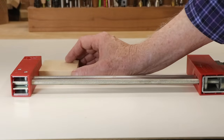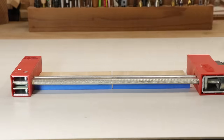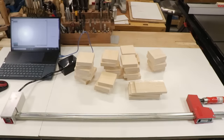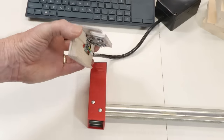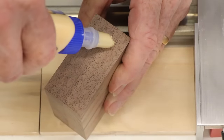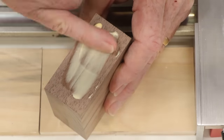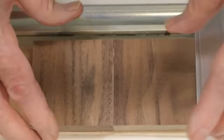I clamp up three to four pairs at a time in a parallel jaw clamp. To keep the clamping forces centered, I made some spacer blocks — I've temporarily added blue tape to make it easier to identify them. I wanted to keep the clamping pressure consistent, so I built an electronic strain gauge specifically designed to measure clamping force. It sends a signal to my computer so it can be easily read and saved. Glue came from a brand new bottle, and I applied it to both surfaces at the same time, trying to spread the glue evenly and thoroughly. I just want to be sure that every surface is saturated evenly.